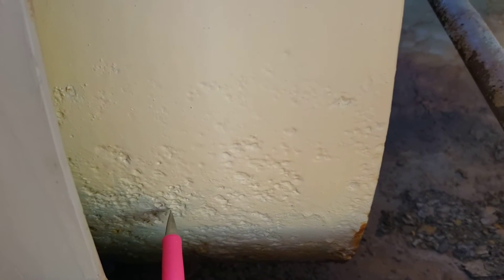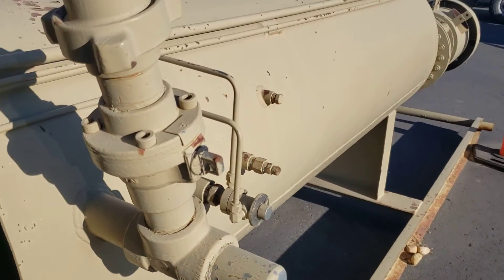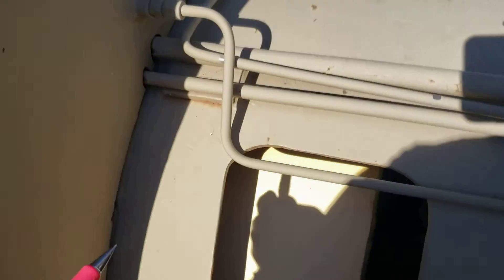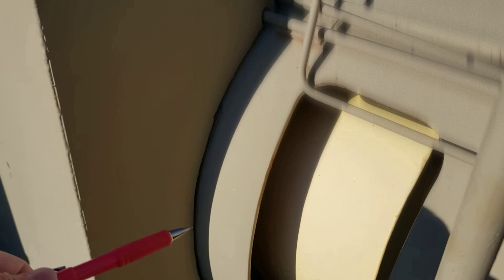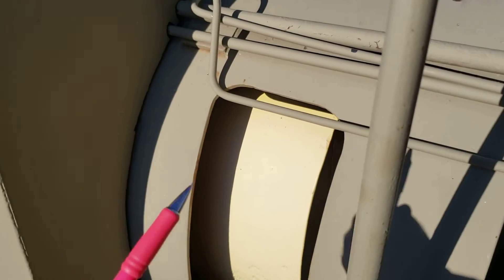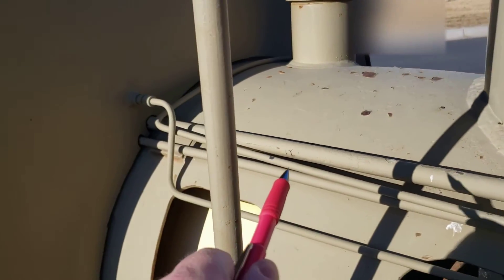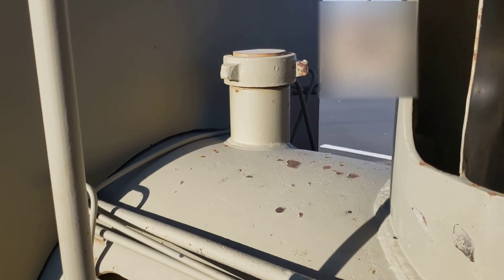I want to call your attention back to the sides of the weir box — notice all that heavy pitting. You don't get that in the WTI oils. You can build these things however you want: you can have flanges on the main chamber, flanges connecting the communicating chamber or gas dome to the vessel, and flanges on the sales end of the main chamber so you can pull it to get to the weir boxes. A lot of them have a threaded nozzle connection right here that goes right down to the top of the weir boxes — sometimes bigger than three inch, like a six inch.